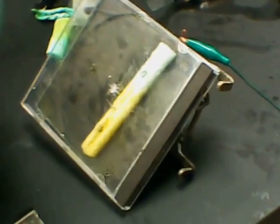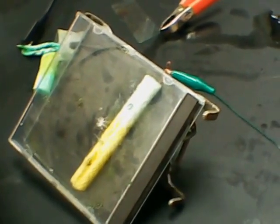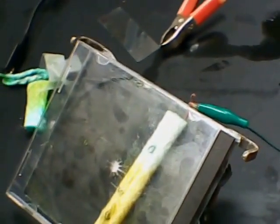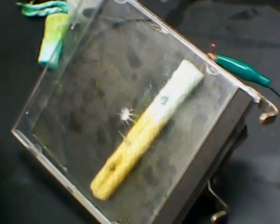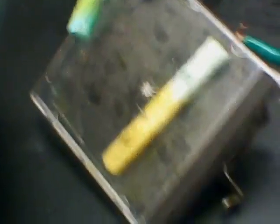What I have found is that if I take a 1-to-2 molar ratio of vitamin B4, which is choline chloride — readily available and rather inexpensive — and mix it with malonic acid, then heat it up to 70 degrees Celsius in air for about 10 to 15 minutes, it becomes an ionic liquid that is fluid at ambient temperature right down to 0 degrees Celsius. It's a pourable gel at lower temperatures, but importantly it's dissolving copper oxide in significant amounts, and the solution becomes greenish in appearance.